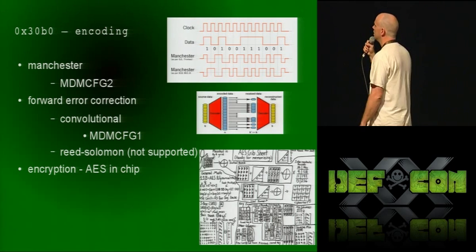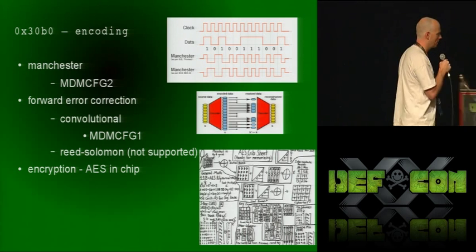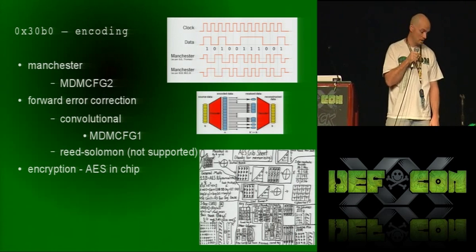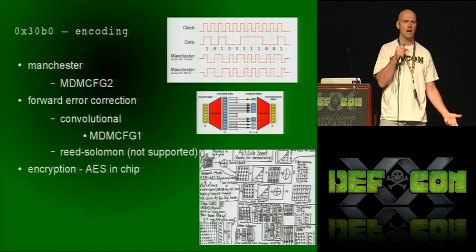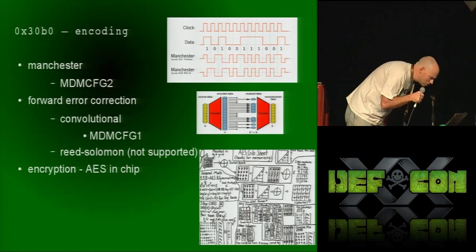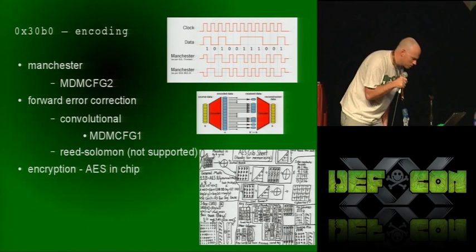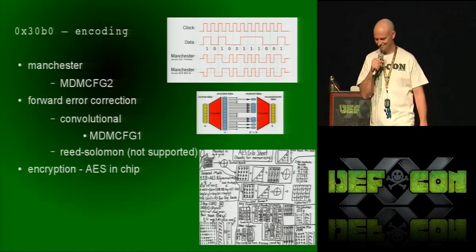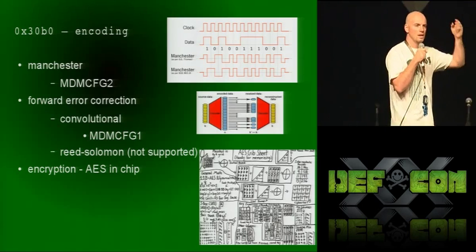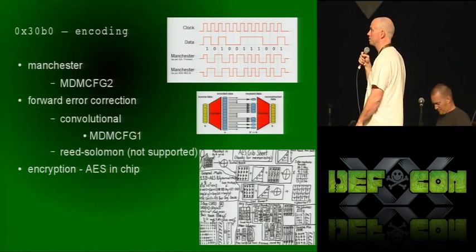In the top one, there's Manchester encoding according to GE. And on the bottom, in the opposite fashion, who knows why, patents probably, the exact opposite, which is put out by some hack known as IEEE 802.3. The idea being, though, you've got a consistent transition that provides its own clock, and synchronization problems go away a lot easier with Manchester than any other.